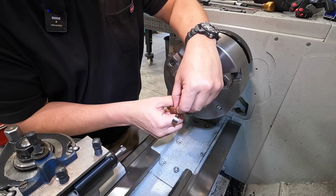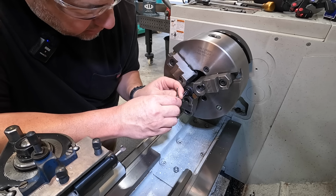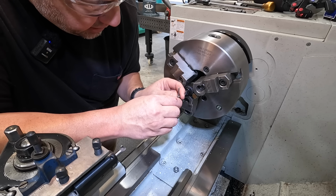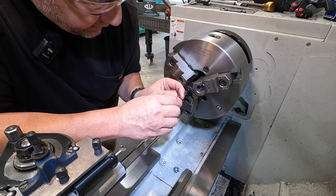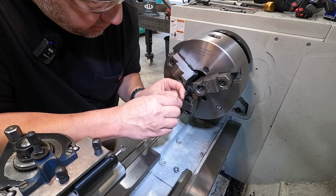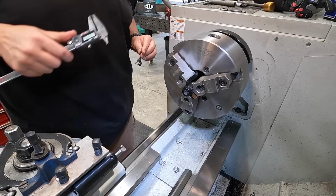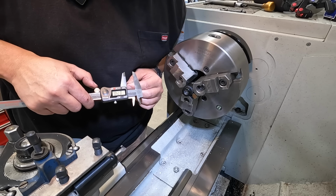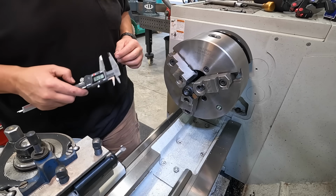And we got our little Yankee spring calipers here. Go in until I know that it's not touching both sides, and then try to bring it out, rocking it until I get that touch top dead center. I'm gonna go with that right there, see what we get. Touching right there on 748, so that's telling me I know it's gonna be right where it needs to be.